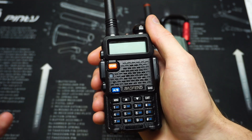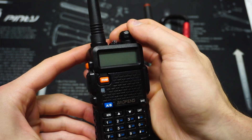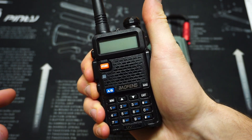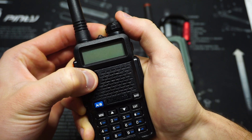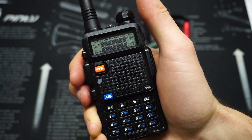To unlock it, it's easy. The radio has to be off, so make sure the knob is turned all the way to the off position. Then hold down the push-to-talk, the monitor button, and the VFO button, and turn the radio on. You should see 'Factory' pop up, meaning you've done a factory reset and can now enter the frequency.